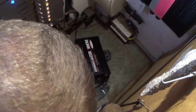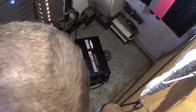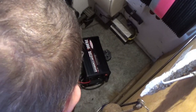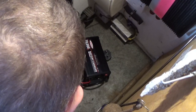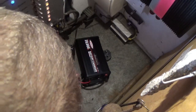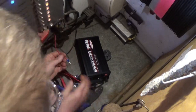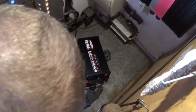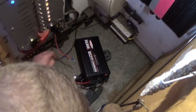Select the blue connector - the middle one - and line it up so the wire is just poking out of the end. Give it a crimp. And the crimp connector tug test: if it's a bad connection, chances are it will just pull out when you tug it.